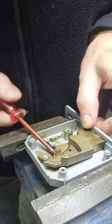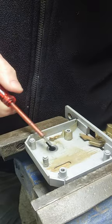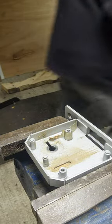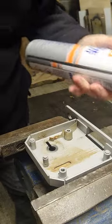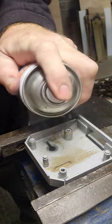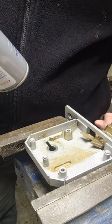The bolt normally does come out — easier said than done on a three-inch lock, so it's not that easy to get out to be honest. Put some silicone spray in there. Don't use regular WD-40 because it's just an oil and it sticks to it. Always use silicone WD-40 — do use a silicone one.